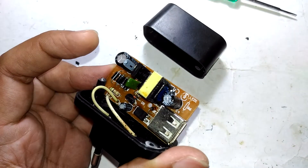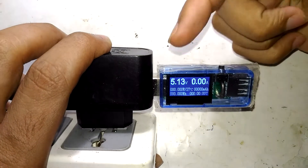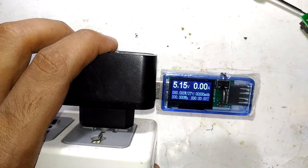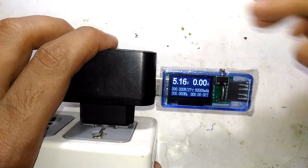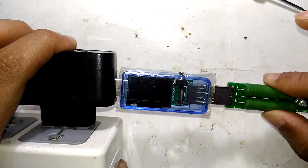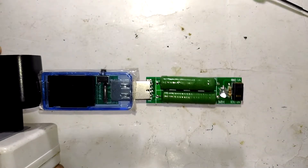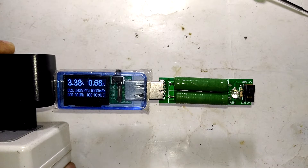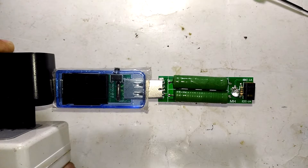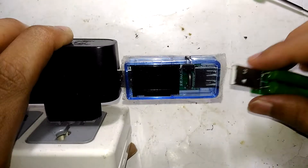I've paused and connected it to a USB power meter — I'll link the full review of that in the description. I'm plugging in my USB load at 1A mode to see if it can drive 1 amp. Nope — it can only put out 680mA and the voltage drops to 3.3V. So it's definitely designed for a 500mA load; it cannot drive a 1A load.